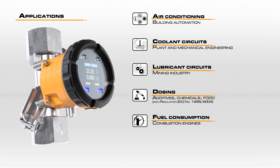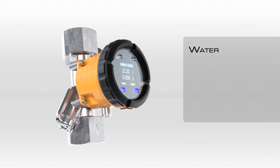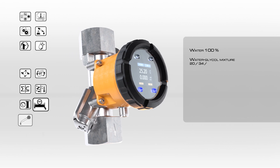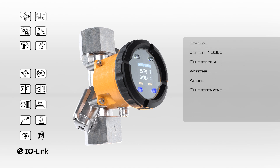For combustion engines, the DUK offers an abundance of integral functions and can measure a wide variety of different liquids. For pharmaceuticals, the precision delivered by the DUK ensures the highest accuracy for dosing processes. The DUK boasts an exceptional turndown ratio of 250 to 1, and can be used with homogeneous Newtonian liquids under 68 centistokes that allow ultrasonic waves to pass through.